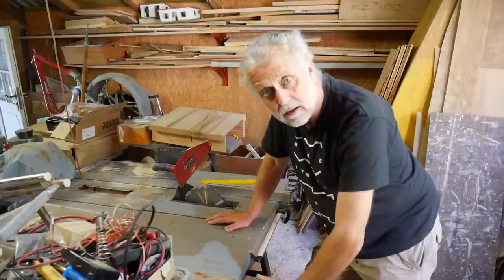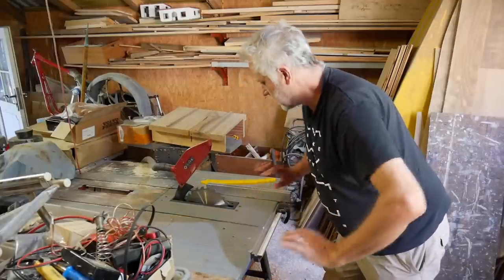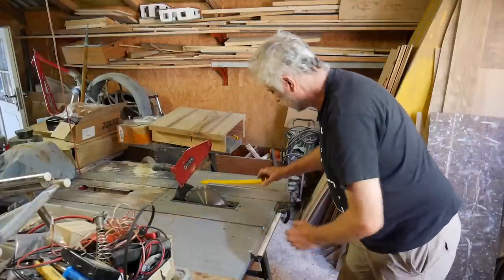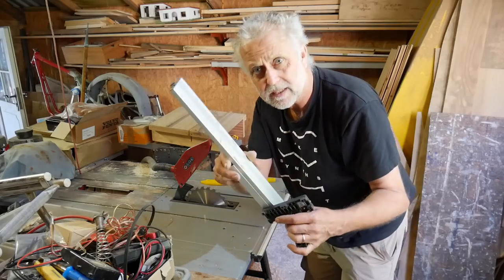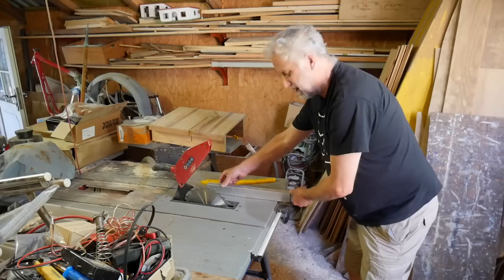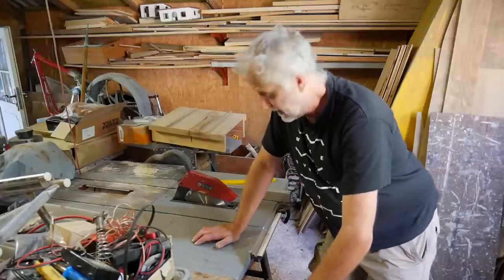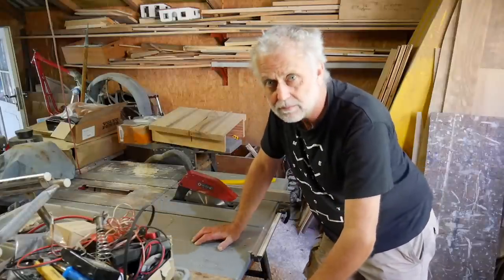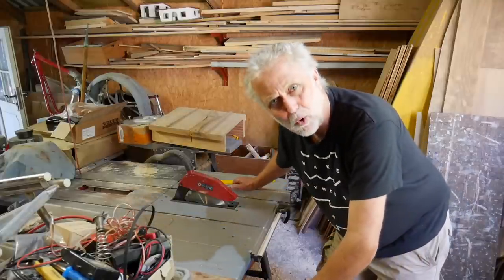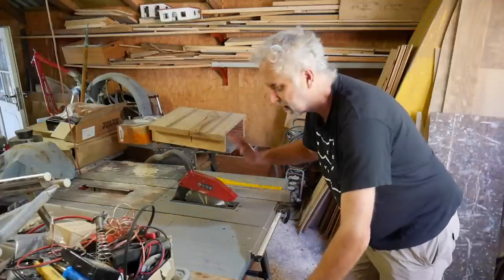They have enough power to cut to a maximum depth of 9 centimeters. If you're cutting anything thicker, you've got to cut it from both sides. They're very good. What isn't particularly good is these slide guides, because they're only fixed at one end and they're a bit wobbly. So you've got to bear that in mind when you're cutting. Watch what you're doing. Draw a pencil line and cut to that. These are a guide, but not more. They won't hold it.